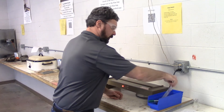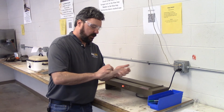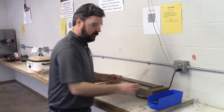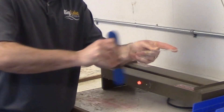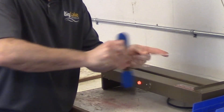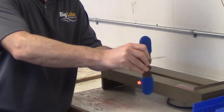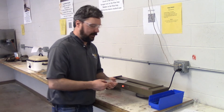There's a set of directions here with measurements and bending locations on a strip of plastic. The plastic strips probably have the protective coating on them, so we want to remove that. Also, these have been cut on a table saw, so the edges are pretty chipped up — we want to clean up those edges while it's still straight. You'll find an edge scraper up here with a couple of different profiles. I'm going to hold that at a slight angle and scrape that edge clean. I'll do the same thing to the other edge — that's the rough one that was cut on the table saw.